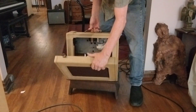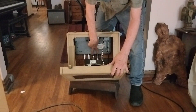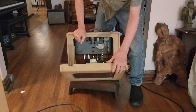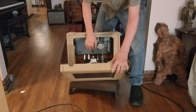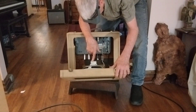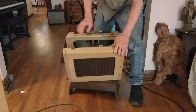This is the inside. It's got the output transformers from a Deluxe Reverb reissue. We have two 6V6s in push-pull, fed by a long-tail-pair phase inverter. Then we've got a 12AX7 here — we're using both gain stages on that. We've got the TMB tone stack in there and a 6X5 rectifier. The speaker is an Eminence — a Traynor Yorkville Sound Limited, licensed by Maryland Engineering, specially for Yorkville Sound. It's an 8-ohm 12-inch.